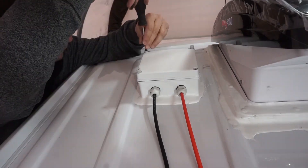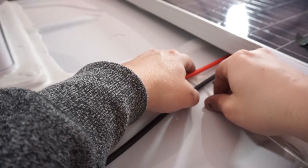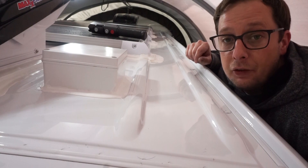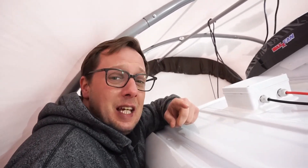We take our cap and that is our fully sealed box. For these wires I'm gonna do the same thing I did underneath the panels: take one of these little pads, stick it down in between, then feed zip ties through. We now have our cables nice and secure on top of the roof, and underneath we have our wires that come down through the roof all the way to the floor — they'll plug straight into the solar controller, which we're not setting up right now. But that, my friends, is how we hooked up our solar panels in parallel with our own custom junction box. If you haven't subscribed and you made it this far, maybe consider doing so. If you have subscribed, thank you, and we will see you next Sunday.